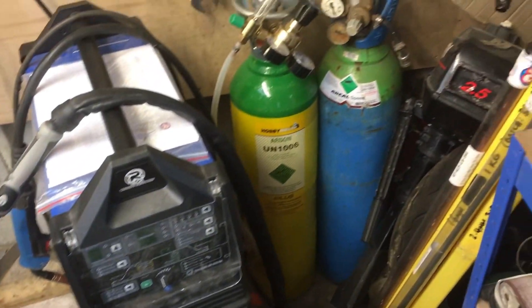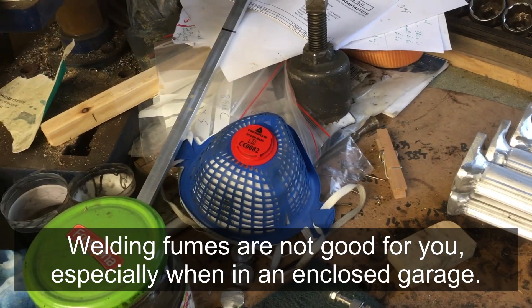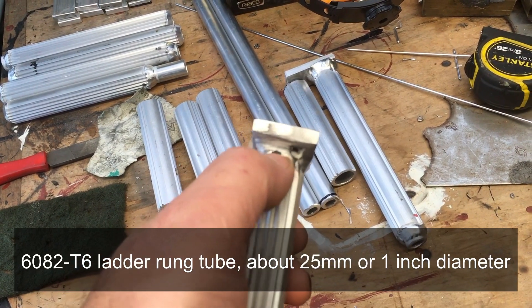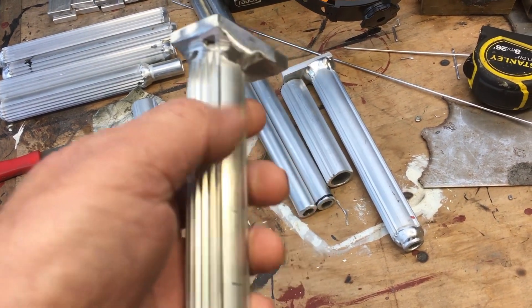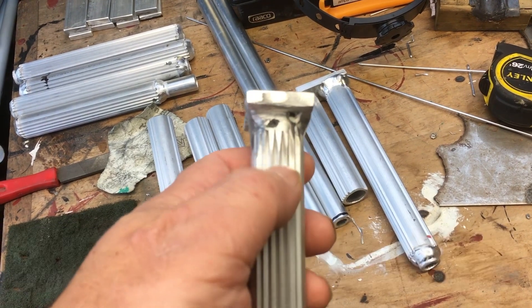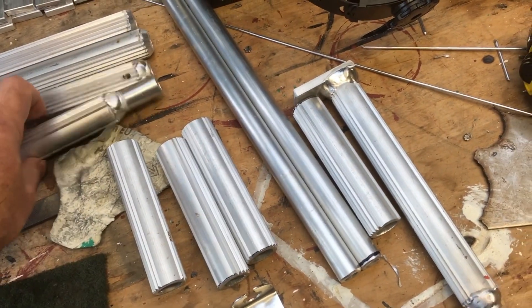Trying to get everything ready. The welder over there — I think they supplied too much gas in that bottle, over-pressurized it, which is great because it means I've got more gas. Here are some of the steps I've already made. I'm wearing an FFP3 mask now all the time when welding aluminium — just helps keep the fumes away. I was welding this one up and you can see there's a blow-through — that little hole there — because it's two tubes welded together with a very small gap. Where I overheated it slightly, the air inside pushed out through that hole and made a big mess.